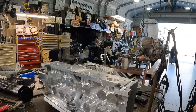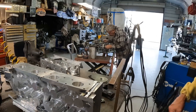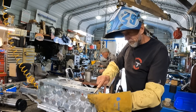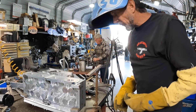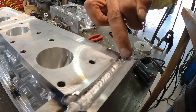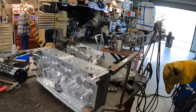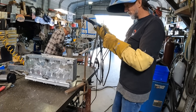So you're just building it up basically a pass at a time? Yeah, the first pass is your root pass and you just want to get down in there as far as you can get. You don't need to do too much at once or you can get porosity. So how many passes does something like that take? Two or three, maybe four. You can see right here something happened in the machining process — see how wide that is? It's a real tricky joint to make it look straight and consistent, build it up, and then it'll be resurfaced down.